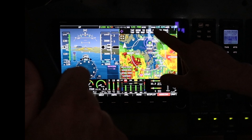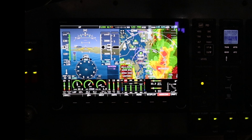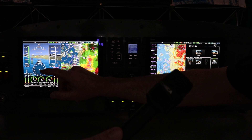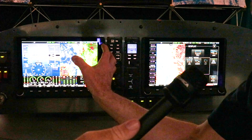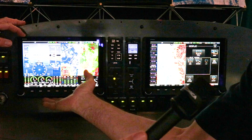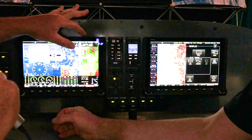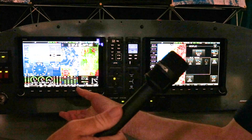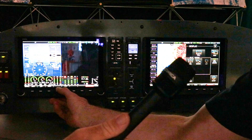There is a problem with touchscreens, though. When you're using it like an iPad, it's typically on your knee moving with you. But when it's out here, your arm is outstretched a little bit — and aircraft can be riding thermals. So we have hand grips everywhere, including on the bottom ledge, so you can grab the bottom and use your thumb with your hand coupled right to the display. We also texture the edges. And we always give you buttons — you don't have to touch things. All the controls are down here and I can navigate without having to reach up to the screen.